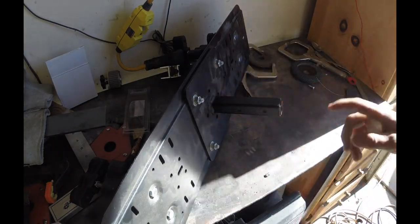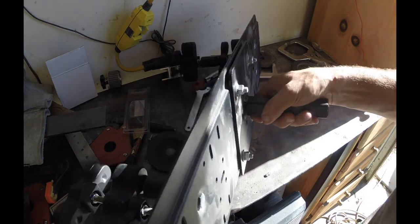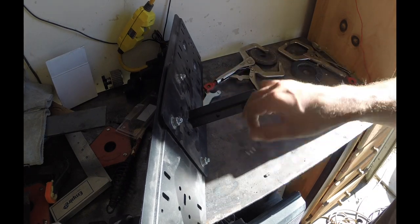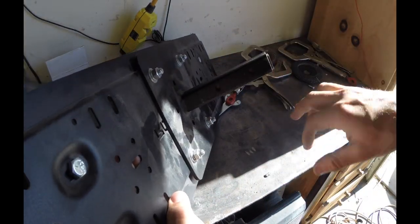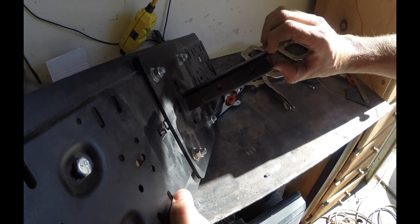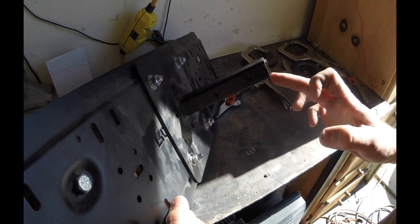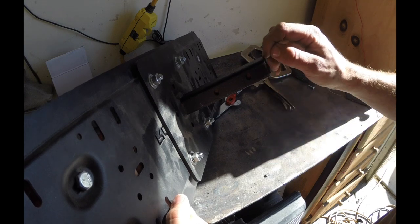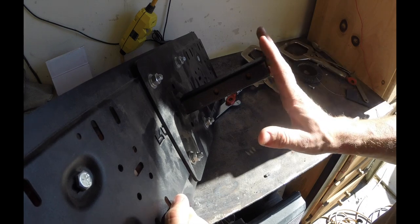One issue is we're going to put a new hole through here, and when we do that we're going to lose some metal. Unfortunately, where I center-punched the hole is right next to an existing hole, which loses strength. So what we're going to do is take some of this square tubing, put it in here, and run a bead around it. Luckily for my length, as we saw earlier, this little piece sticking out won't hurt anything, so I can run a bead here, here, and here.